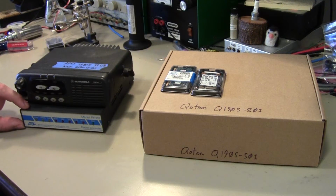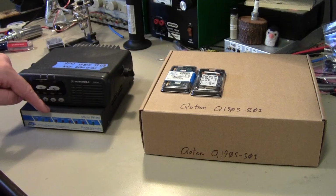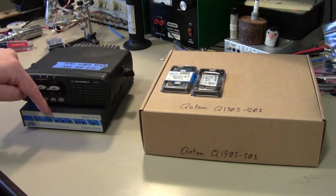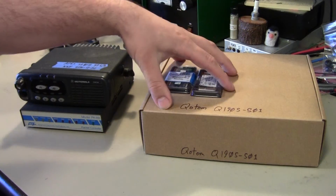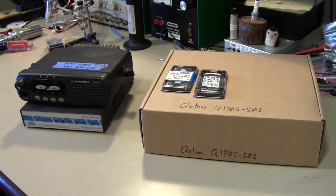But it's a bit difficult because the APRS spec is kind of a moving target, and so inevitably the terminal node controllers don't quite behave the way that you would want in a modern network, and so you will oftentimes see these acting just as the KISS modem with a serial port over to a computer running a Digipeater software package such as APRX, which I'm the maintainer of.